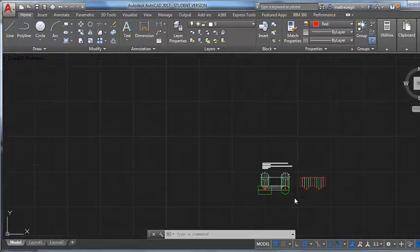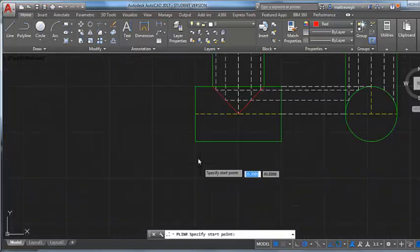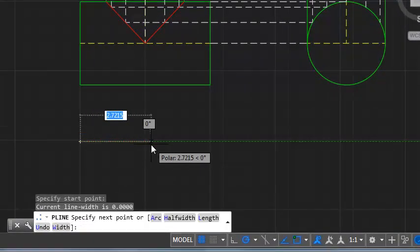The way we begin that is I'm just going to blank out the rectangular size of the header, and I'm going to do it below it, so it's kind of orthographically projected from where I've drawn the header. I'm just going to use polyline and draw it in below here. So this way I know the length, which was an arbitrary length we determined. We did this as a 5-inch long header, and we put our branch on the center line of that.